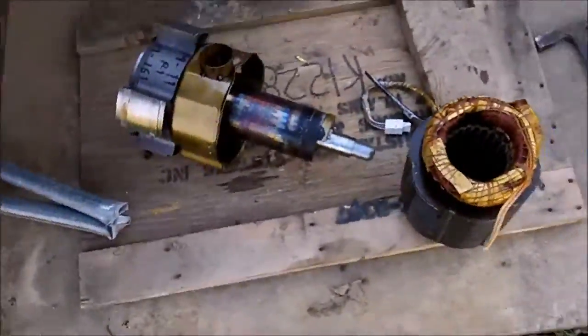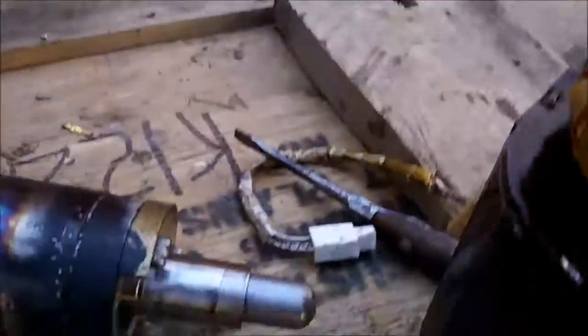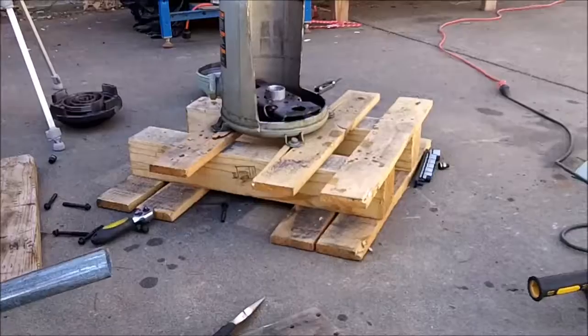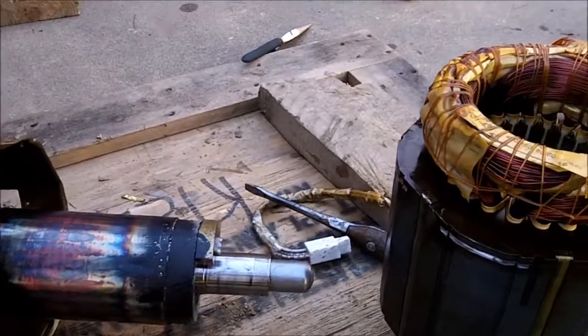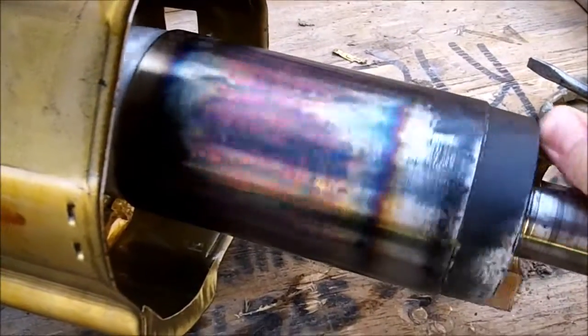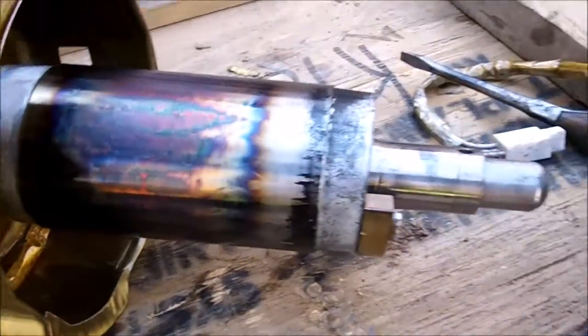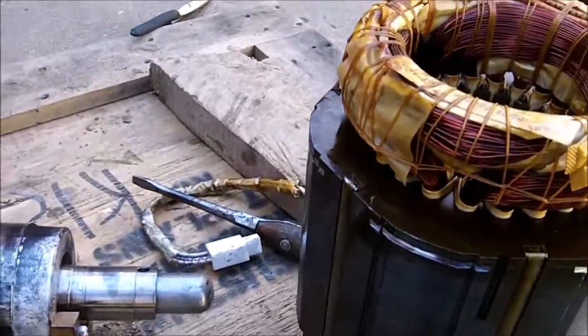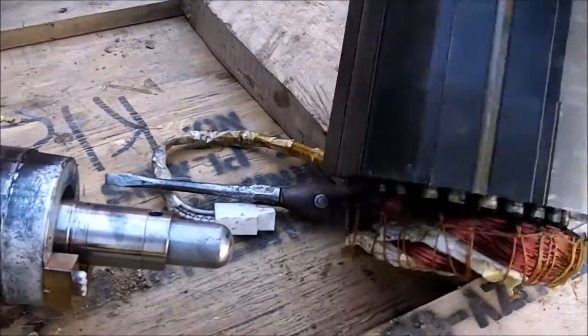The reason all the main windings are shorted — I thought it was a problem with the plug right there, but it isn't. It turns out this compressor has been fairly used. For some reason they put it back on a pallet and sealed it up — possibly a factory recall or something. But if you look at the rotor you can see severe discoloration, an indicator of extreme heat. These windings are just burned up. They smelled burnt. The oil smelled burnt. Everything. It's pretty much just the insulation on the windings burned up.